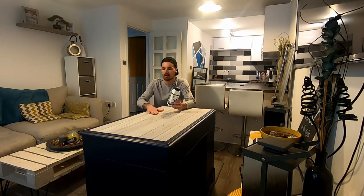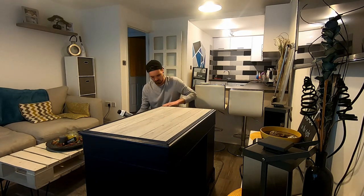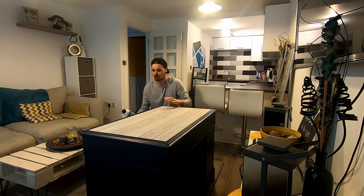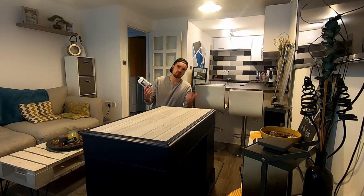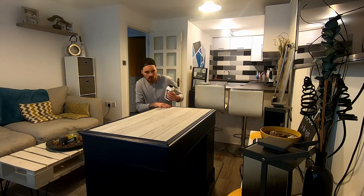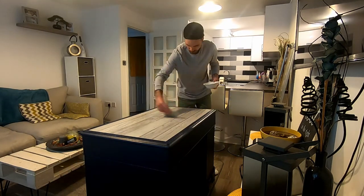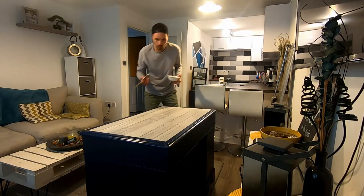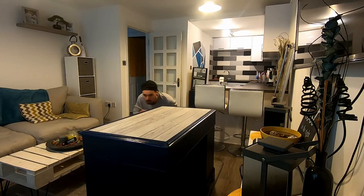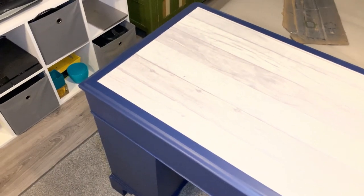The wallpaper has been on overnight to dry and it turned out pretty good — no corners coming off, it's down solid. We're now going to put Polyvine on top as a protective coat, probably two to three coats. That's the first coat done and it looks well covered — leaving it for about an hour before the next coat.